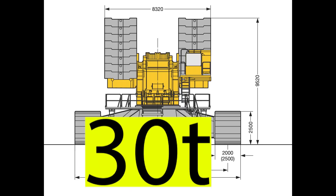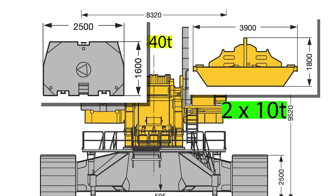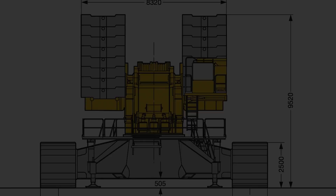For comparison, Frankencrane had a much lower central ballast, amounting to no more than 30 tons, with no option to increase it. Its counterweight on the superstructure was 340 tons, divided up into two brackets of 10 tons each, plus 32 plates at 10 tons each. The superstructure stands 9.5 meters tall — one and a half meters more than the new crane.